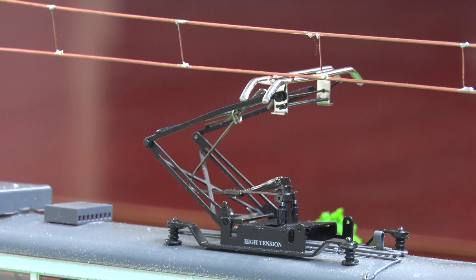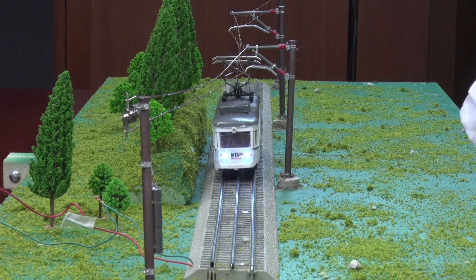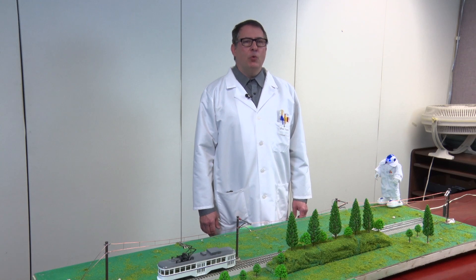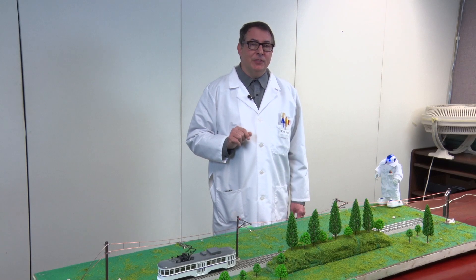We need two wires because the amount of power required to energize the LRV is so high. Next, we see that the light rail vehicle has what's called a pantograph that slides along the contact wire to pick up current to power the LRV. We need to stagger the orientation of the contact wire so that it sweeps across the pantograph as the LRV travels. If the catenary wire were straight, it would cut through that one spot that it rides across the pantograph. The term catenary refers to the shape a wire makes when supported only at its ends.